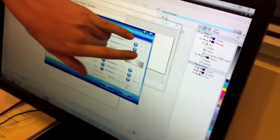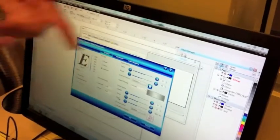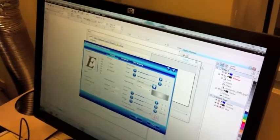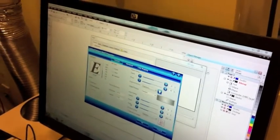There is not a precise relationship here. There's no math. Like with welding, when you use 16 gauge, in fact, it is even dependent on material. You can get all of these percentages mapped out for wood, for how much you need to drop your power relative to your speed, and then try it on acrylic, and it doesn't work. So pretty much bring a notebook and record everything. Bingo. Right. If you lose notebooks, make a hidden layer in your file, take notes there.